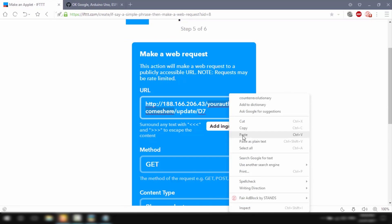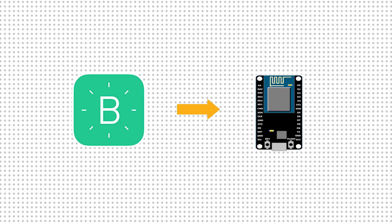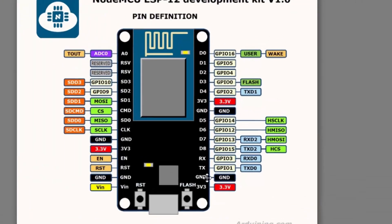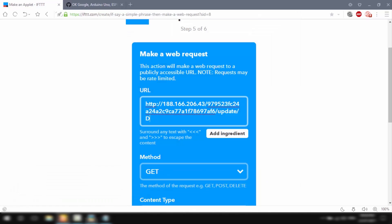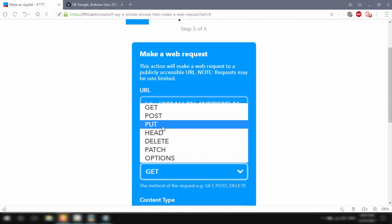After the forward slash, type your auth token from the Blynk project email. Next, specify the digital pin of the NodeMCU you want to control. Since we want to control relay 1, which is connected to digital pin D3, we'd type D3 — but we can't write D3 directly because the Blynk server assumes it's sending the command to an Arduino board. So we write the Arduino pin that corresponds to NodeMCU's D3, which from the diagram is pin D0 of Arduino. So here we'll write D0.